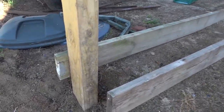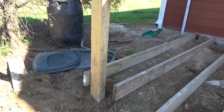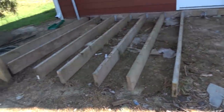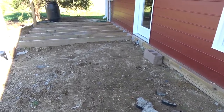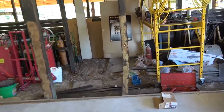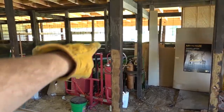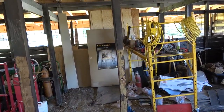Tough break about the shadows, but we got this post in and it's pretty straight. I put a level on it and put some concrete at the bottom — some people do that because it'll harden and hold better. It's not nailed in yet, but the next step would be to put a long board here, nail everything in, and keep going following the pattern until we get out to about here. I need more materials to get any of this done, so that's a job for another day. However, this post is broken — it's not one that holds the load. The ones that really hold the load are these 4x6s. This one was always just for holding doors and joints, so I'm going to take it and pull it out.